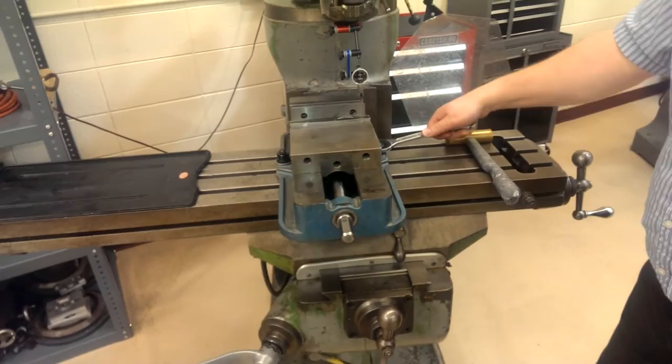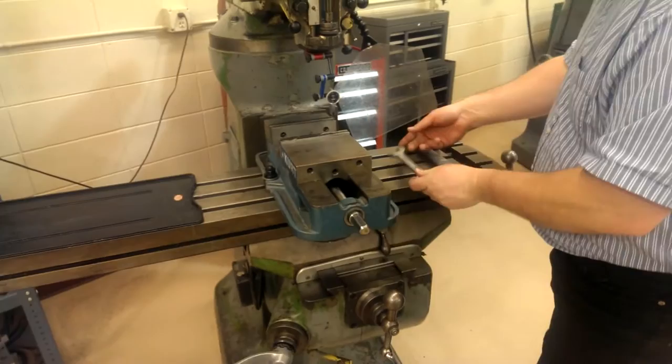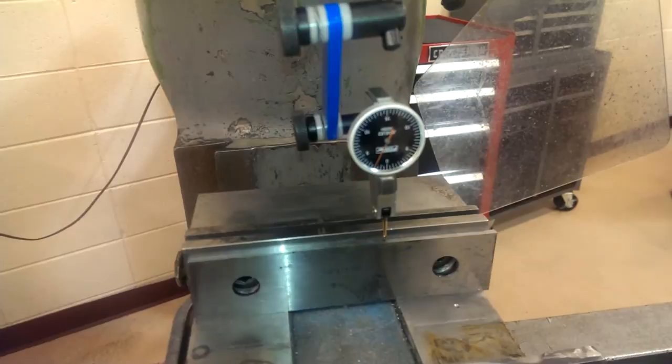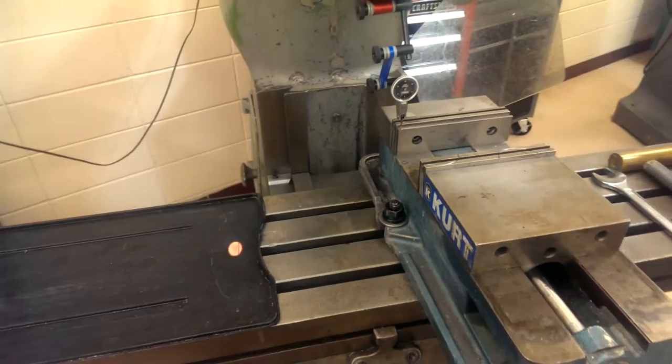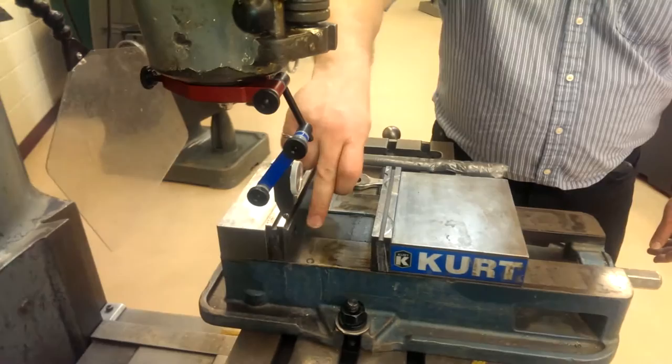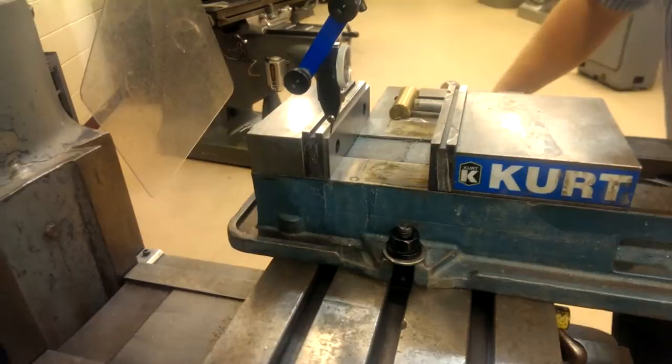Once you do that, you'll want to check it again — just run it back and make sure it didn't move a whole lot. It's fairly constant all the way across, although it moved off from its original point. So the next thing is to put the contact point on the vise and check to see if these surfaces are parallel to the way as well. We've got to move the axis around a little bit and move this forward.